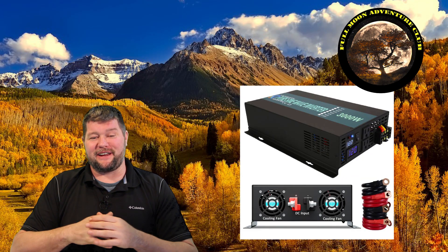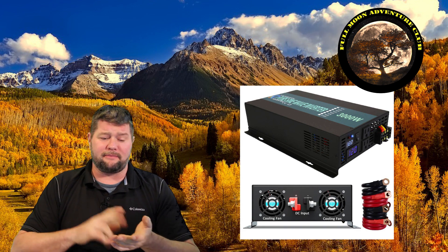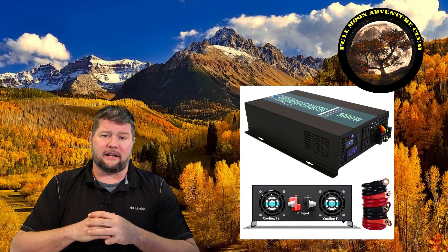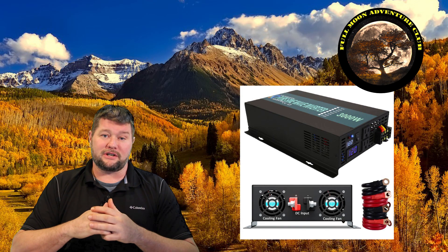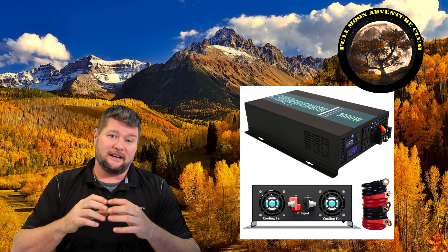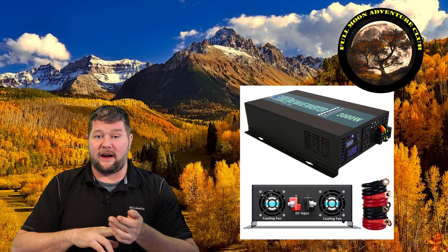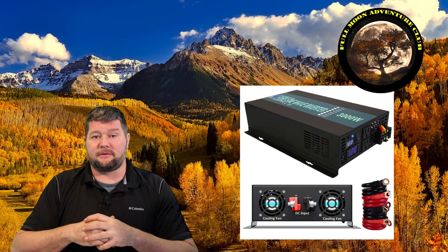I hope you enjoyed the peek under the hood. I'm not an electrical engineer, but I do a lot of electronic tinkering and everything looked pretty solid to me — the MOSFETs, capacitors, and wiring all looked well-engineered and sturdy enough. With the testing, it can definitely handle a 3,000 watt continuous load — and we surely surged over that quite a bit toward the 6,000 watt surge rating. It didn't overheat, there were no weird smells, it did everything just fine, and I ran the test for a good 15 minutes while I walked away and it performed perfectly.